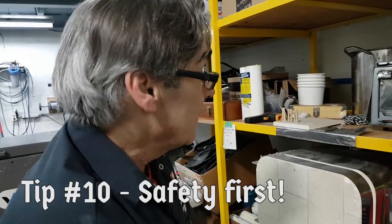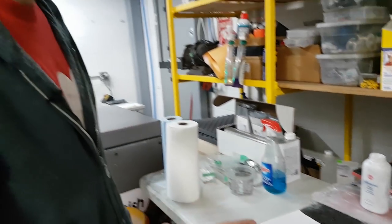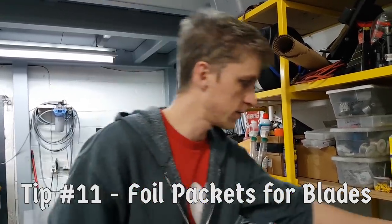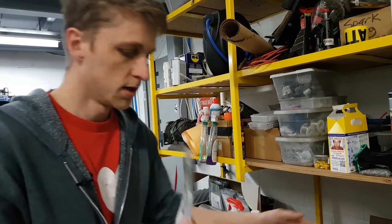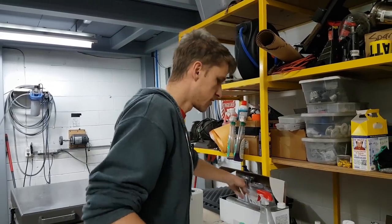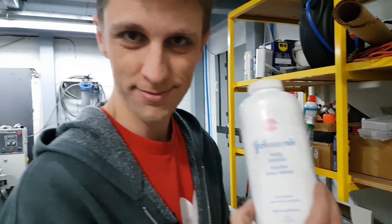Always remember to put your gloves on when you're opening an oven that's 1,935 degrees. Give you guys two really quick heat treating tips — this is not a how-to, but we love these foil packages from Valpack that seal the blades from oxygen contaminants while you're heat treating. These are awesome; they are laser welded, save us tons of time. We used to fold the seams before. So that, and also baby powder — I'll leave it at that.